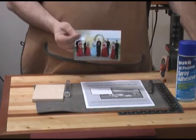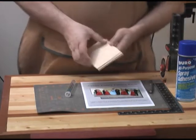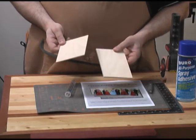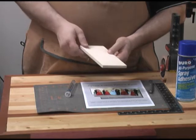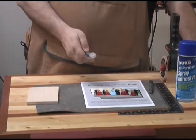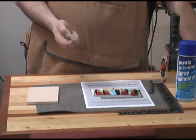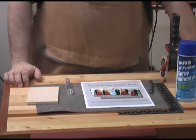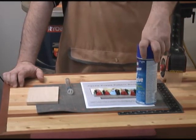You're going to find a picture that you want to make the puzzle out of — in this case a 4x6 wedding picture. You're going to need a couple pieces of Baltic birch ply cut to size: a 1/4 inch and a 1/8 inch piece. The 1/4 inch is what we'll make the puzzle out of, and the 1/8 inch is what we'll apply the template to and put on top of the puzzle as we're cutting. You're also going to need some fine scroll saw blades — I'm using Flying Dutchman Superior puzzle blades. You'll also need some spray adhesive to apply the picture and the template to the ply.